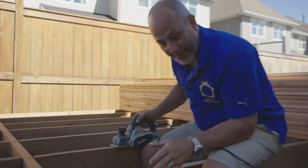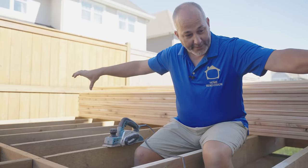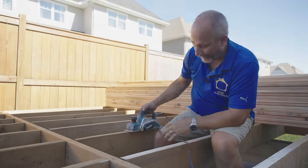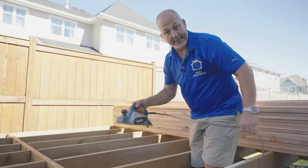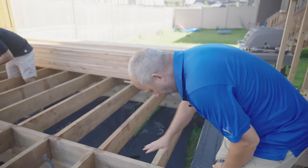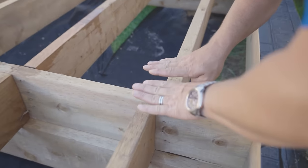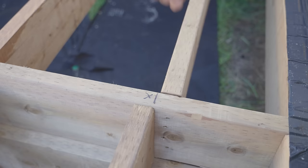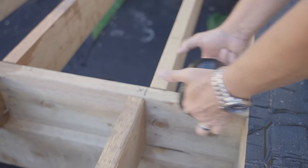Just a reminder — the reason this is necessary is because it's a box beam, which means I have two pieces of wood bolted on a post, and they have their own different crown situation. So meeting in the middle, it is possible for one side of this board to be higher than the other. When you're building, just don't worry about it, keep moving forward. This takes 10 minutes. As we're putting on our deck boards, if we get to a point where the water is going to land right where everything is nailed together, I'm going to cover that in joist tape — just give a little extra protection. The deck boards might only last 50 years, but the frame itself probably lasts 100 if you take good care of it. That's the secret.